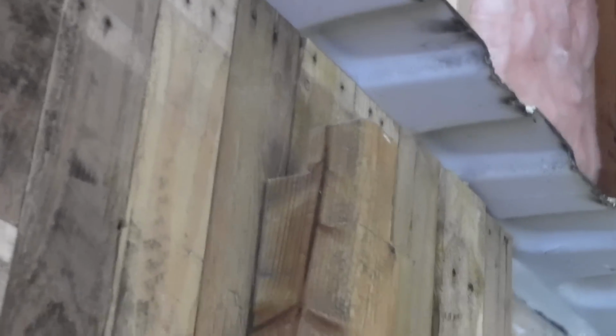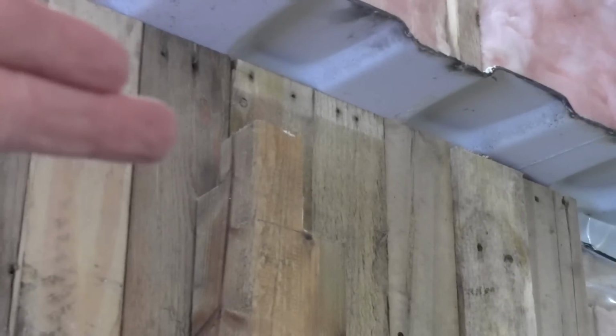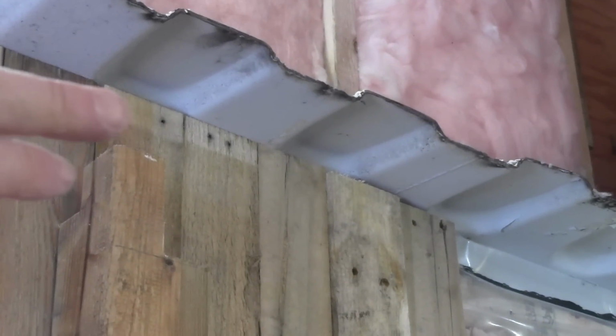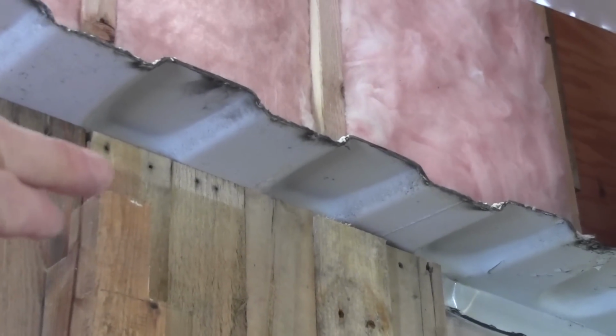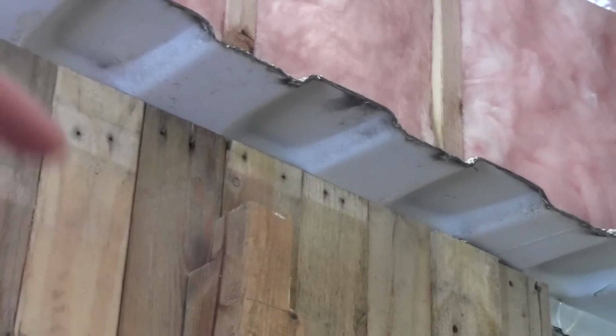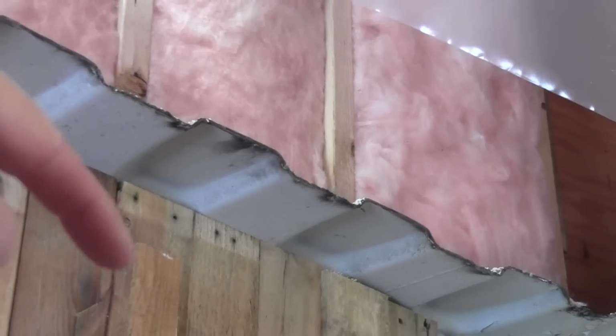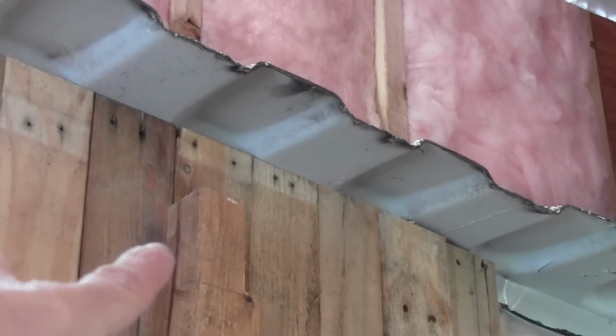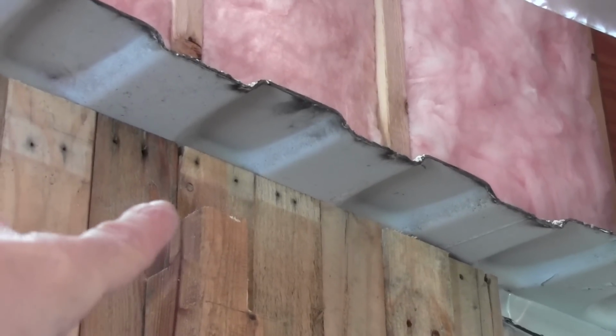And then I had to cut a notch out of the back here. And once this is all together, that's where I'm going to have 2x4s, again with a half lap cut in it, so it would fit in there and sit on top like that. That'll be a blind half lap, so I can actually screw in from the top, and I've got 2 surfaces then that are supporting it, that one and the top.